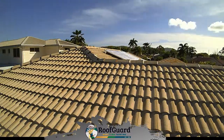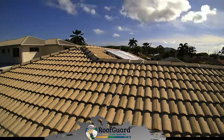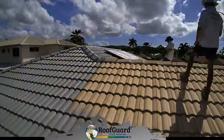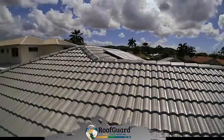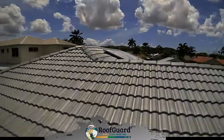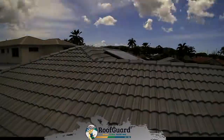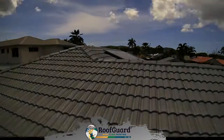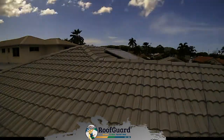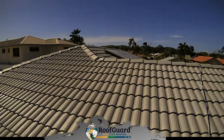That allowed us to simply cover them with biodegradable plastic drop sheets and proceed with the application of primer. After the primer was dried, we proceeded with applying the two coats of roof guard solar reflect polyurethane heat reflective coating. The role of the primer is to seal the tiles and allow for the smooth finish at the end.